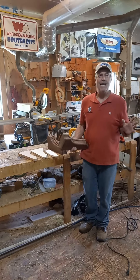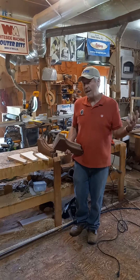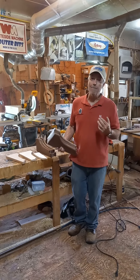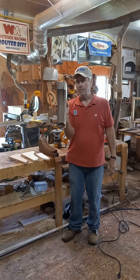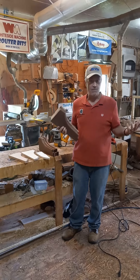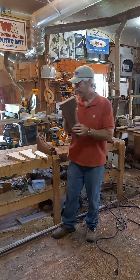Hey, I'm Gary Strigler and today in the shop I'm working on making a custom craftsman-style walnut mantel for our client. Because we don't have much room to get a good bit of mantel projection, we're making some custom corbels. The way I made this corbel is actually pretty simple — it just involves three router bits, a jigsaw, and a couple of little tricks I want to share.